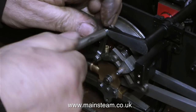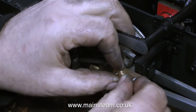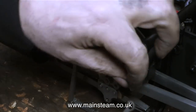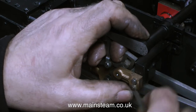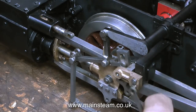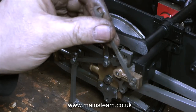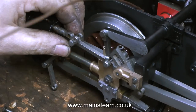When running a miniature steam locomotive, these are the parts that generally get neglected when it comes to oiling, so they wear out quickly. Here I'm fitting the outer motion bracket bearing that supports the expansion link, and you will notice that the expansion link shaft has a small hole in the middle of it. This hole was a bit small so it was re-threaded to 6BA, because on the end of this shaft is a small lever which via a rod operates a mechanical lubricator — the original arrangement with an 8BA bolt was not really very positive. I'll put the lever in place when I fit the mechanical lubricator, but I can't fit that until the running boards are fitted. For the moment I'm fitting the valve gear, and once it's fitted I'm going to get the engine to run and see how it times up, so running boards and a lubricator really would be in the way.